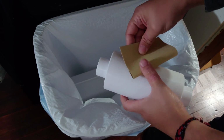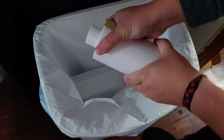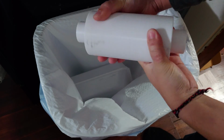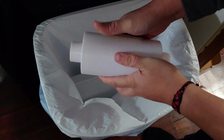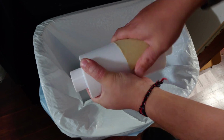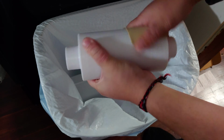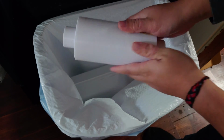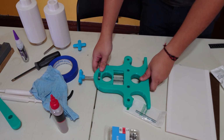The second thing we're trying to do is roughen up the entire surface of this drum. That way it has some grab and it can grab your workpiece. Otherwise the PLA is really slick and it doesn't like to grab the press bed or your workpiece. Over time the texture of your drums is going to go back to smooth because of so much wear and pressure; it's just going to burnish it down. So every now and then just hit your drums with a little bit of sandpaper to give them more bite. And then assembling everything is super easy.